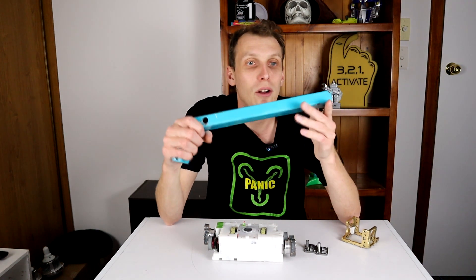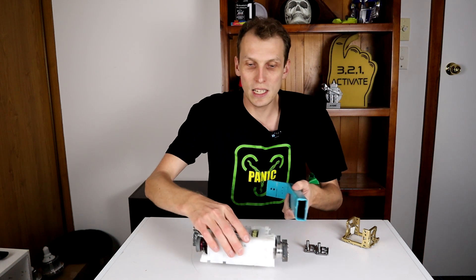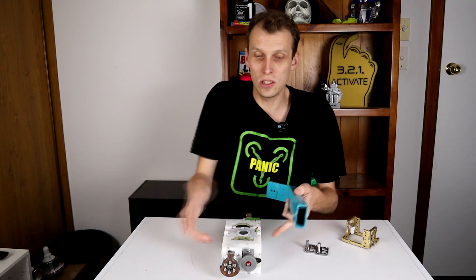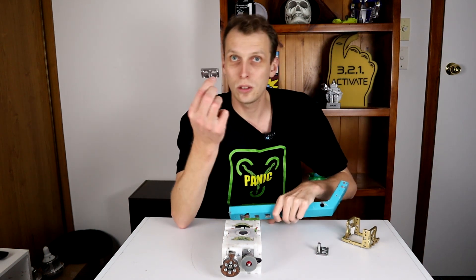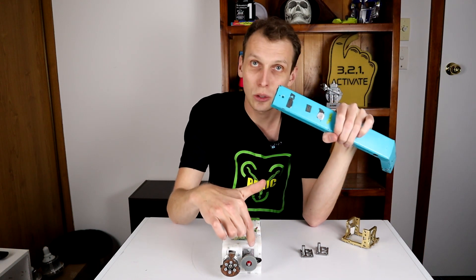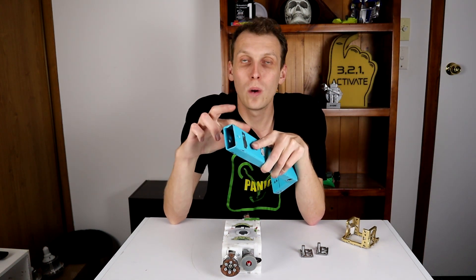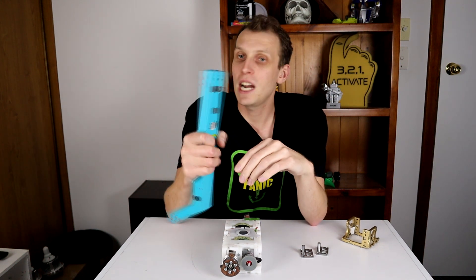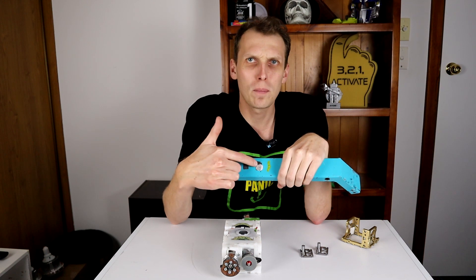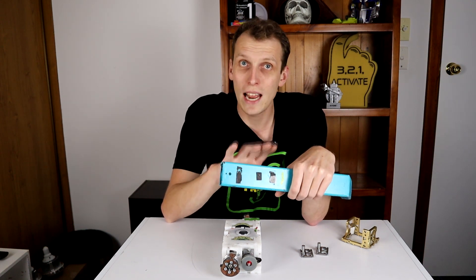This is the weapon arm out of Flop, and this steel we're going to grab and use in the new version of the melty. My idea is to take the wheels and put them back out the sides, and then put steel front and back holding these brand new tool steel plates and also holding the actual motor. The steel is going to be the thing holding everything, which means we should not have things bend and buckle and cause the belt tension to disappear. But this is going to be difficult because I need to put a really big drill through this and have it run past the edge to give clearance for the motor to move around a little bit so I can set the belt tension and lock it in.